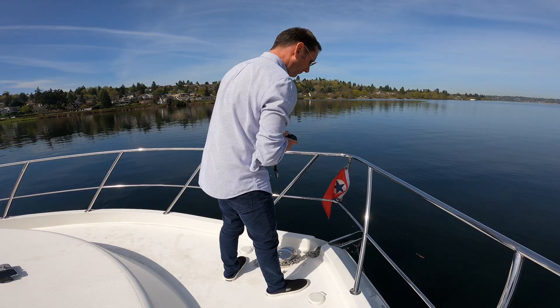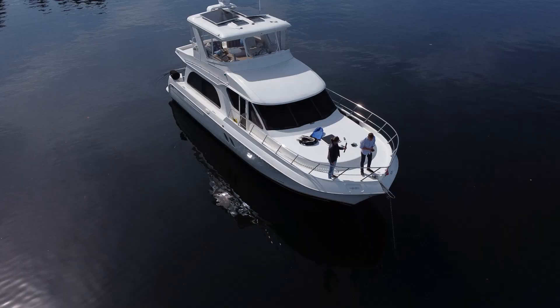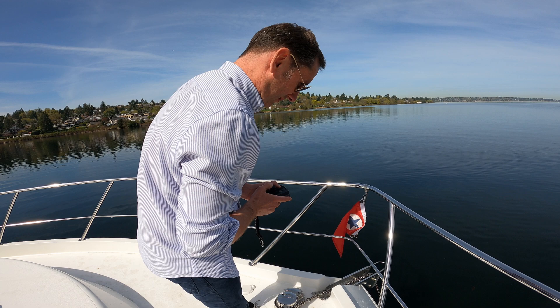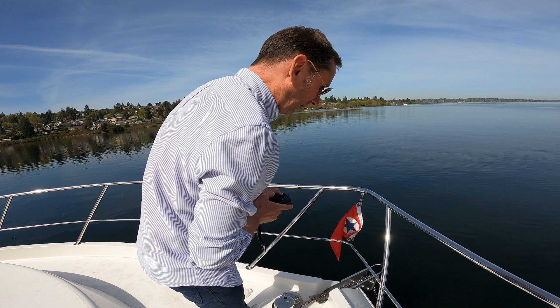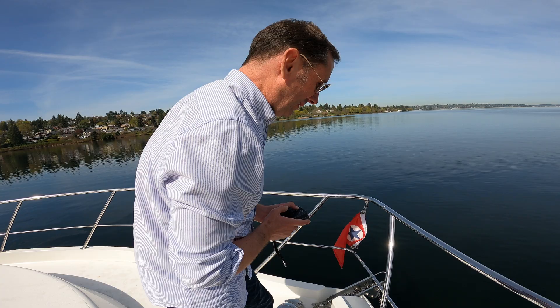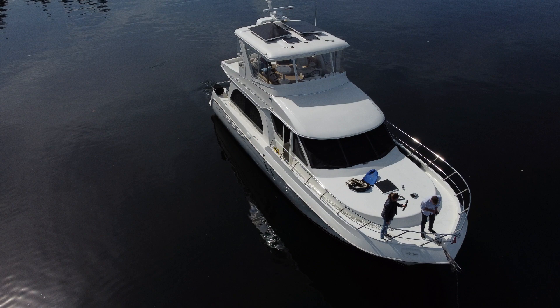Now we can steer and power the boat towards where the anchor is without putting undue pressure or weight on the windlass. You don't want to put load on the windlass — it is only there to pull up your tackle. I'm just keeping the slack out of it. We don't want to overrun our tackle and get it in our running gear, so that would be bad.